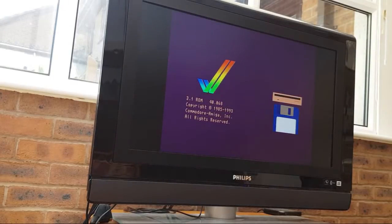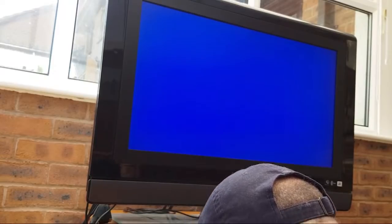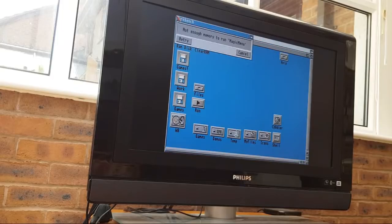Yeah, anyway, I won't show you, but I'll connect the drive up and we'll see if this one boots as well now. So I think that difference has to be the difference in the GALs, actually. Like one of them's got a slightly weaker connection on one of its signals or something. I don't know what else it could be, unless the 245 on this one, maybe it needs swapping out. Maybe if I swapped the other 245 on this one for a brand new HCT 245, things would be different. I don't know.